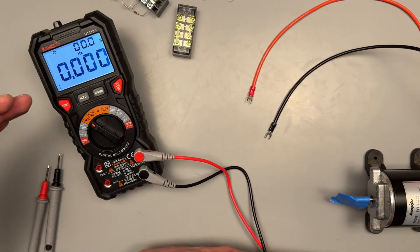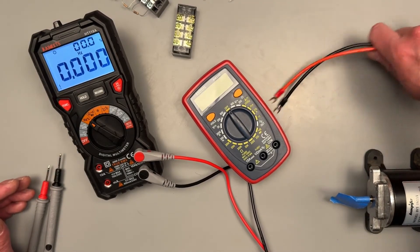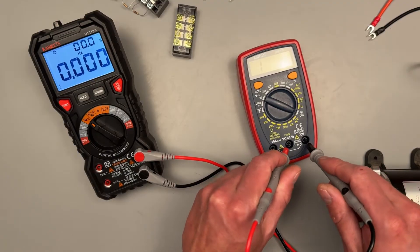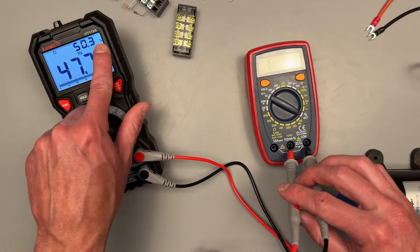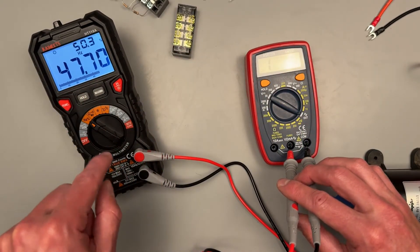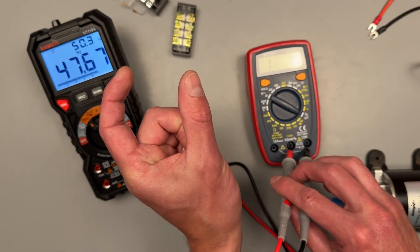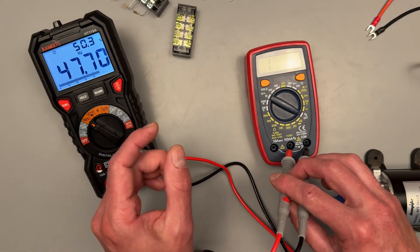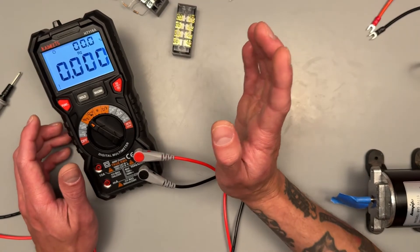Next we have our dedicated hertz and duty cycle function — hertz and duty cycle are two different measurements. There's a note that for this setting no more than 10 volts AC or DC. This little meter outputs a square wave, and it's reading 47 hertz — so hertz is on the bottom and the percentage sign is duty cycle. We're reading a square wave pulse where power turns on and off. Frequency is how many times per second it turns off, and duty cycle is the amount of time the power source is on versus off. At 50% duty cycle it's 50% on, 50% off — here it's at 47 cycles per second.